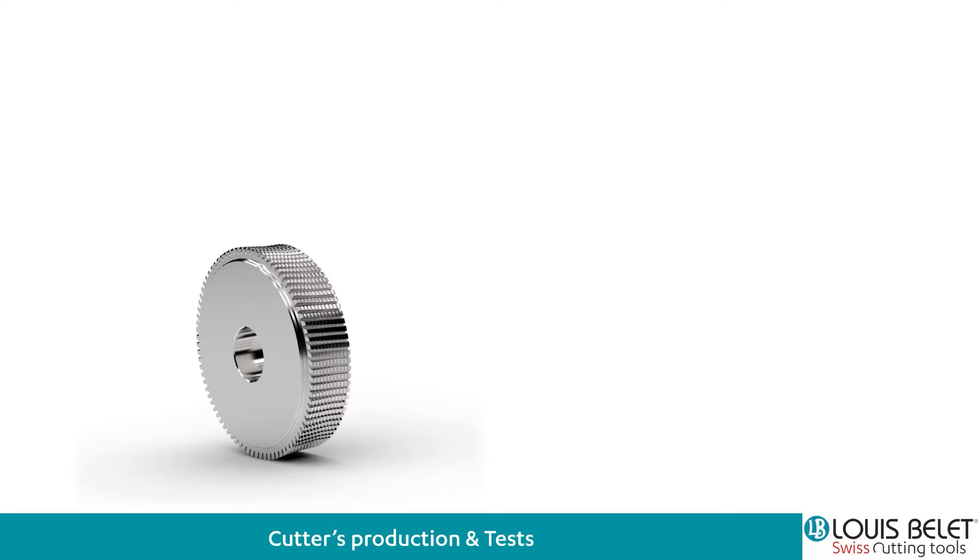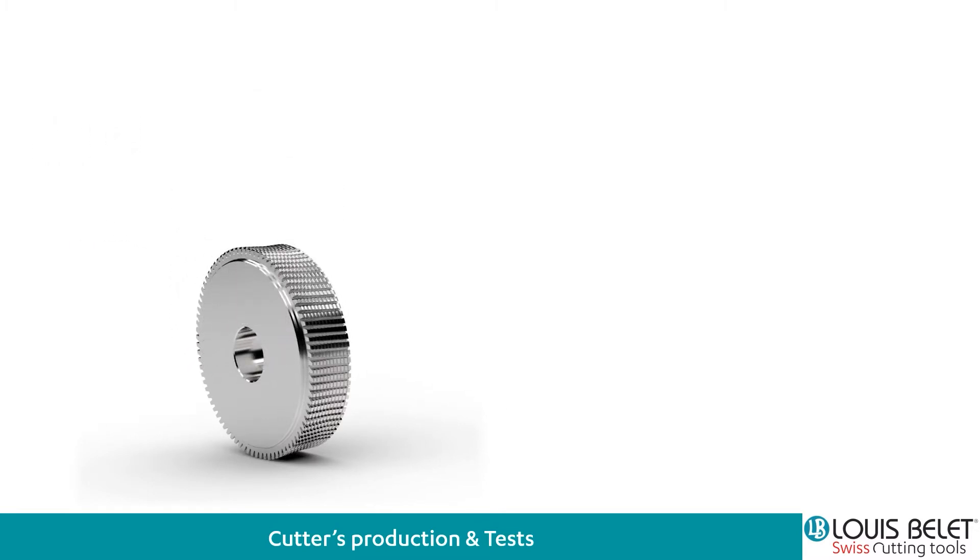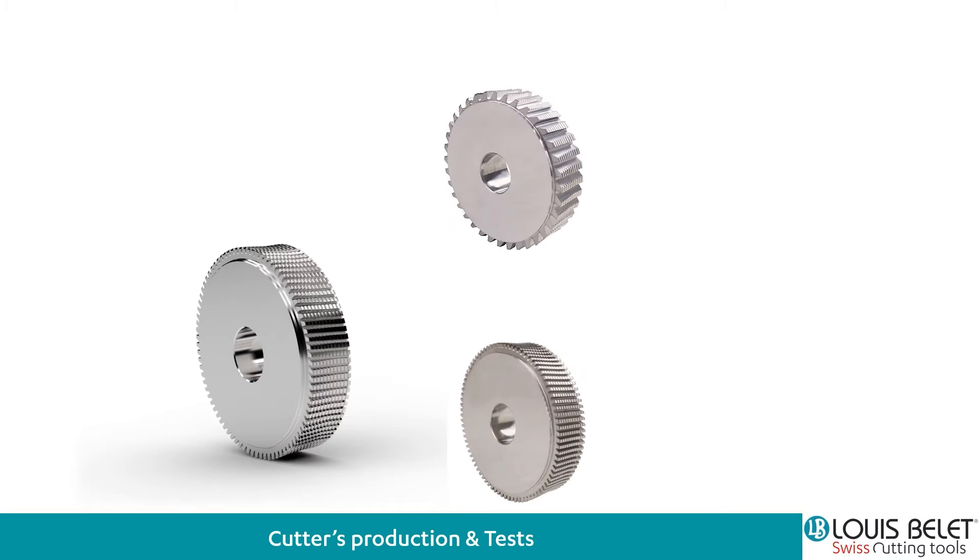This is a 3D representation of the cutter. The idea behind that is really to put all the programming into the cutter, so that means all the programming you will have to do is simply go in and go out and the complete thread will be done. On the 3D simulation we could realize it, and we developed two types of cutters with the same profile but different teeth counts: one with 36 and the other one with 84 teeth.